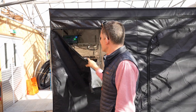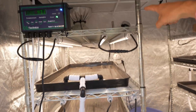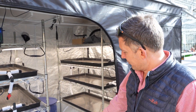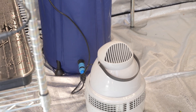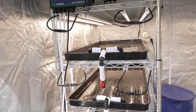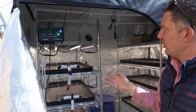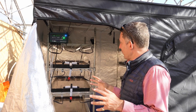Air comes in that bottom corner and is extracted out of that top corner. We're doing about the volume of the room every minute to keep the room moving. Down at the bottom, we've got a centrifugal humidifier. The blue tank behind that provides a week's worth of humidity for the space. It's all operated by a brain up here, which controls both the temperature and the humidity — too hot and the fans go on more, too humid and it sucks out more air.